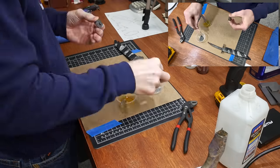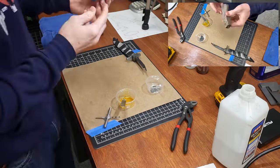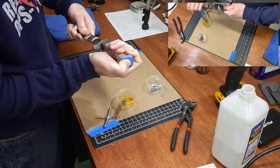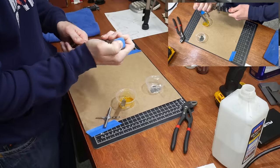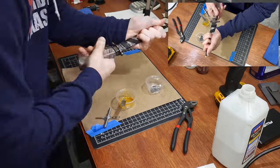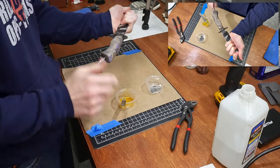With the guard and front spacer on, I slathered a good deal of G-Flex in the handle and pushed it up onto the tang, making sure to keep my finger over the finial hole. I then tightened up the whole assembly, making sure everything went on evenly. The last part is spending about 15 or 20 minutes wiping off any excess glue.